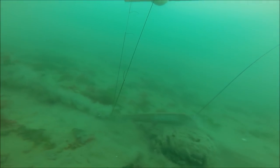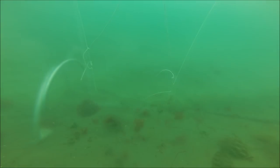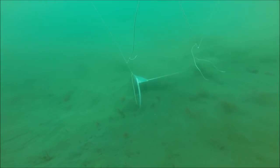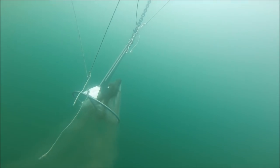Here's the 44-pound Bruce anchor — this is a genuine Bruce, not a copy. Note the heaping of seabed. It did set and stop the boat, and on its rotation — hard to see because of sediment — it did stop the boat again. On retrieval it's perfectly clean, no sediment attached at all. The Mantis anchor consistently sets real hard, just knifes into the ground. On rotation it stays completely upright, engaged in the seabed, brings the boat to a quick halt, with some seabed attached near the tip but the back part of the fluke clean. The Sarka anchor sets initially quite well — very good, really. On the reversal it developed a tiny list but remained engaged and stopped the boat immediately. A little seabed on the tip, but the back of the fluke was very clean.